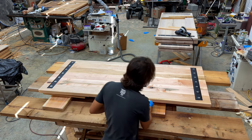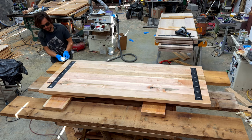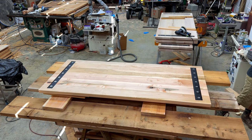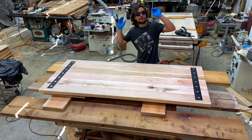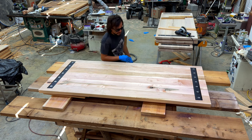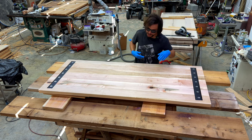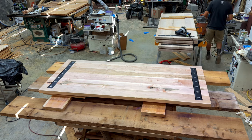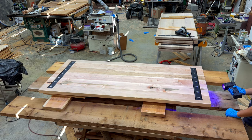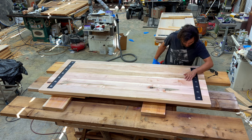I'm going to hit the edges now with the excess, rolling it again just to re-saturate any dry areas because I want to let this soak in pretty good. We're going to take a rag and wipe all of the excess off — I like to do everything with the grain, it just makes sense. Always make sure to wipe clean the underneath edge. You'll always have at least one drip somewhere, so I'd do two passes. First coat's in — we're going to cure it. I'm plugging in my overhead lights. They are two Model 100s from Kuvo Lighting and each one does a 6x6 spread. We wait two minutes for the Clean Armor to be fully cooked.